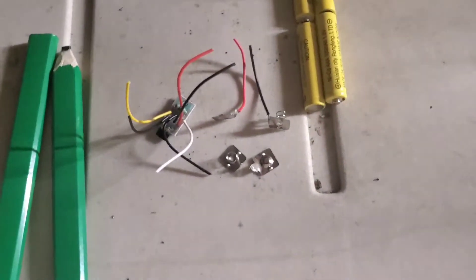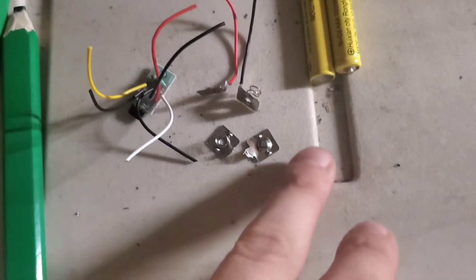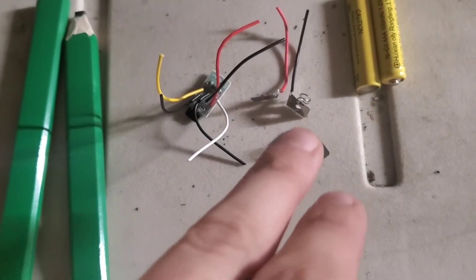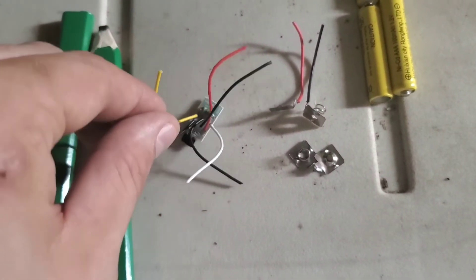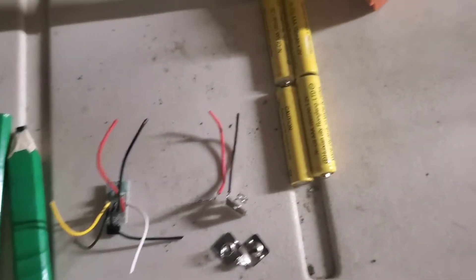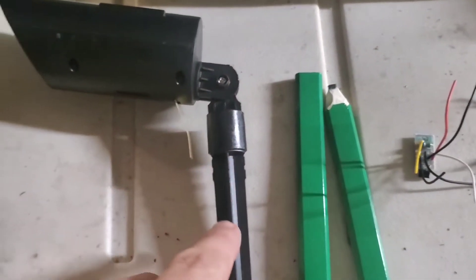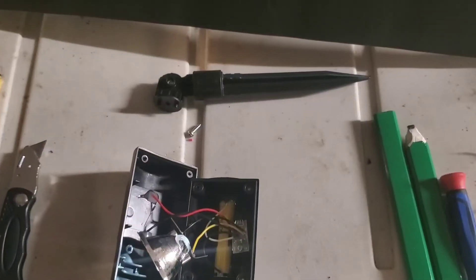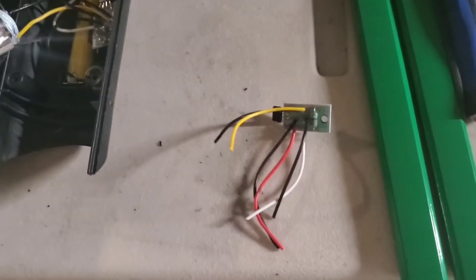While collecting these parts, ensure that you leave two terminals with wires as long as possible, two terminals with short or no wires remaining, and at least one board with all the wires cut as long as possible. Harvest the four batteries. When you get to this part, we're going to be removing the tail section, the spike section, and opening the clamshell for the next step. Once you have the spike removed, you're ready to prepare this board for soldering.